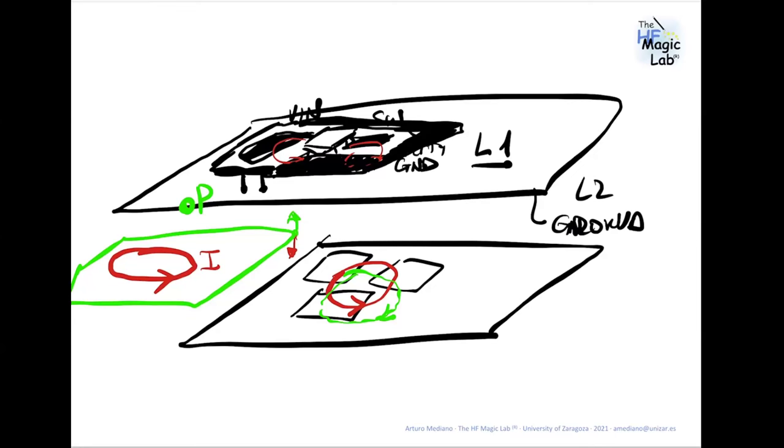The idea is to be able to have the high currents circulating in the dirty ground in the top layer, okay? Anyway, if you are not able to understand this concept, don't do that, and put the ground plane below the components of the IC and all the switching nodes and as close as possible, okay? In this way, multi-layer boards where the second layer is close to the first layer are better than two-layer boards where the distance between the first and the second layer is 1.6 millimeters or something like that. As close as possible is a good technique, and you will have a quiet system.